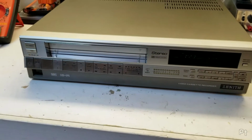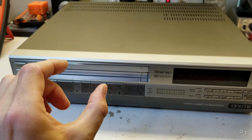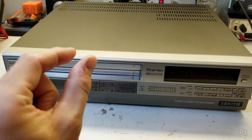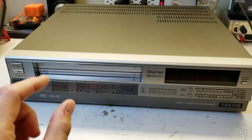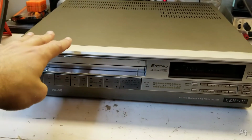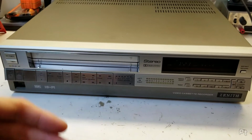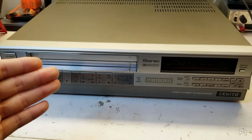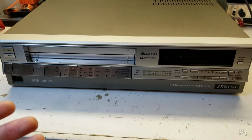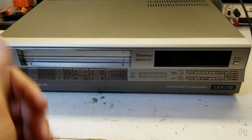If you slow down the tape path where the tape's moving across the head, what you're doing in these VCRs is essentially pushing the tracks closer together. The tracks are still the same number of tracks per second. The video head drum is still spinning at the same speed, and that's what determines your bandwidth, essentially. So the tracks are closer together, so there's a potential for more noise in your signal, but when you're recording at such a low frequency like audio, it's basically immune to that. So the long and short of it is, hi-fi audio sounds fantastic in the slowest VHS speed.